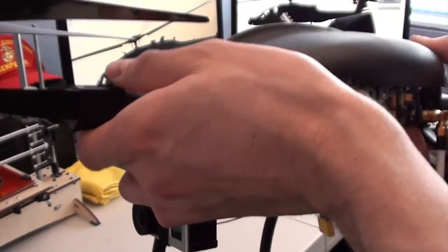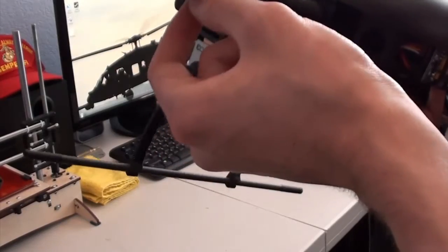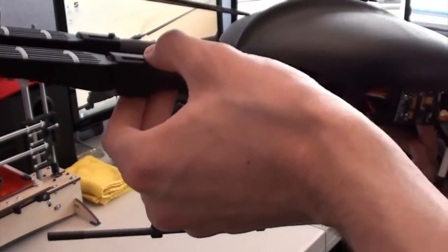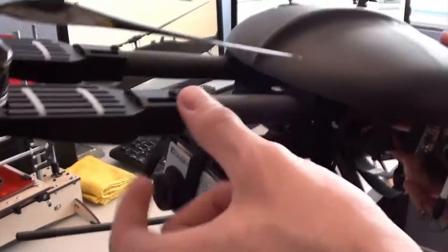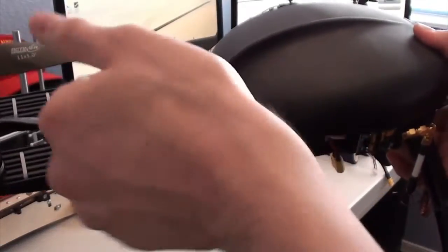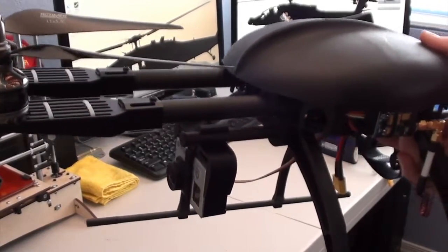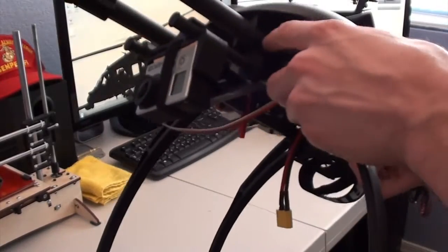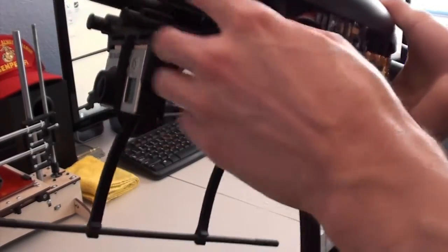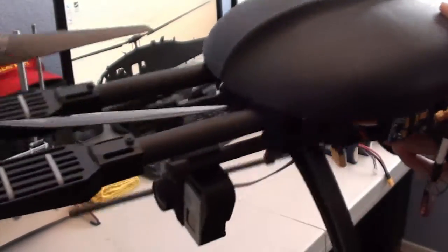Otherwise, what happens is you pass the bolt through, it comes through the other side, but it's very difficult to tell when you catch the thread on the bolt because it's quite tight. So if you ream it out, you should be able to reverse thread it until you feel it grab, and then you can thread it in the correct way. And that way you don't cross thread the bolts, because it would be quite easy to cross thread the bolts on the inside. These were not as bad. These pretty much went right through, no problem.